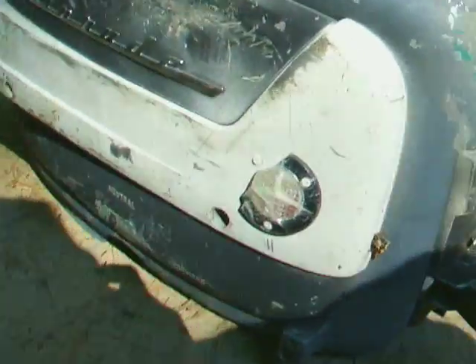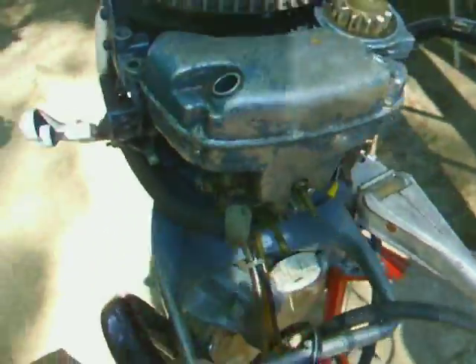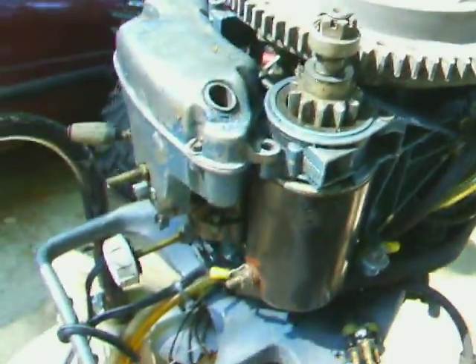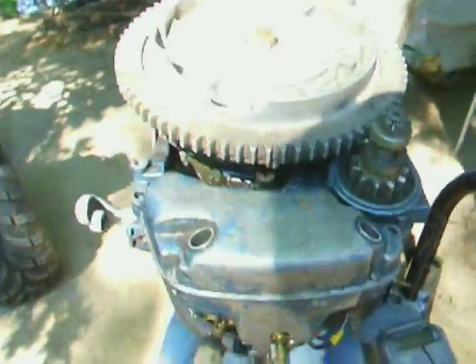Really odd hood style — one side seems made to be mounted permanently to the motor. Runs well, would benefit from a tune-up of course. I have to plug the water pump hole here — it shoots out like a rooster tail, so the water pump is working fine. Just need to get a propeller, replace the lower unit seals. I see some gear oil coming out of the water pump — probably the shaft seal is shot, no big deal. Propeller, shaft seals, straighten the shifter, fix up the choke linkage — it's all messed up. Just some wiring and fuel lines. Away you go. What a laugh.